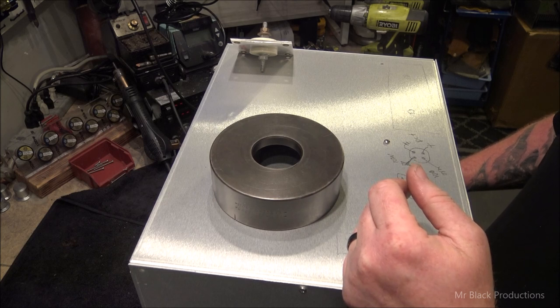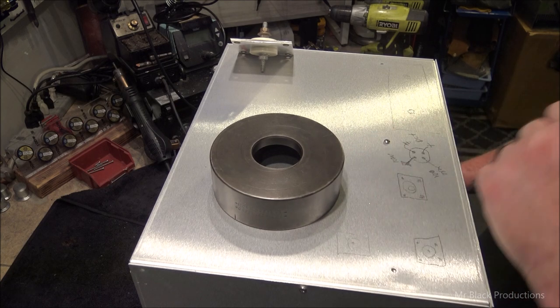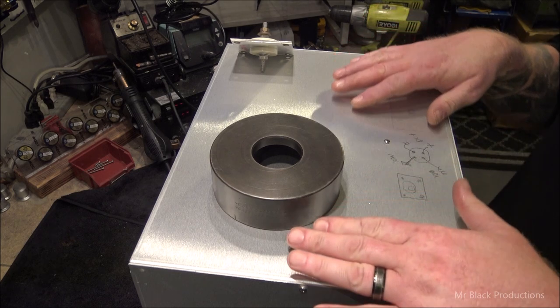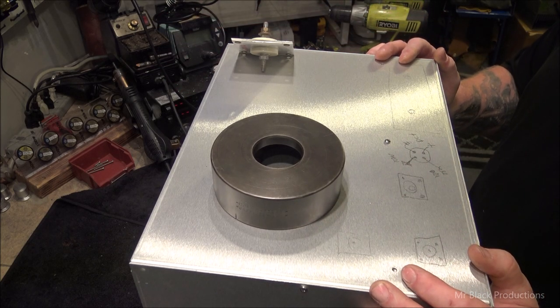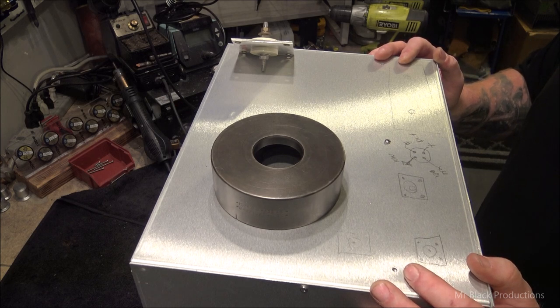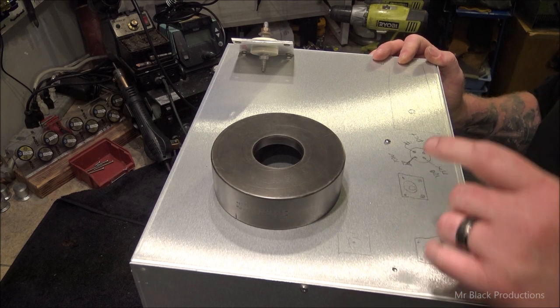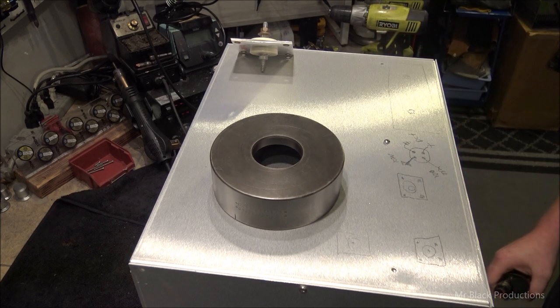So yeah, I've got to sit here and think. What I've really got to figure out is what I want to do with my fan. If I mount it internally, I still need to figure out how I can mount it on some rubber so we're not turning all of this box and everything the box touches into a big giant resonant speaker for the fan vibration, which is really important. Or if we put it out on the side, then all we do is put a little rubber gasket between the fan body and the box. I'll be back. Talking too much, not enough getting done.